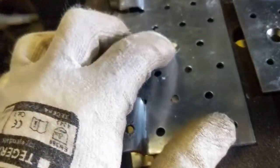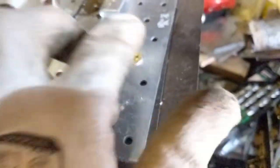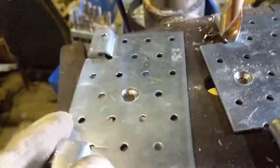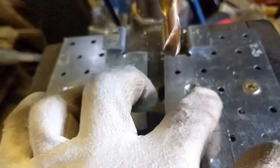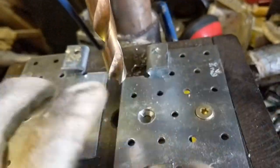Finally, we need to widen the five millimeter holes to six millimeter. This is one side and this is the solar panel on the other side — these two clamp the solar panel. Alternatively, you can go this way, but then the screw will be a bit closer to the edge of the wood underneath.